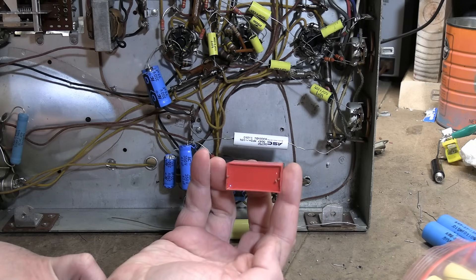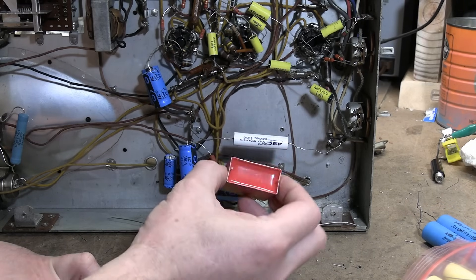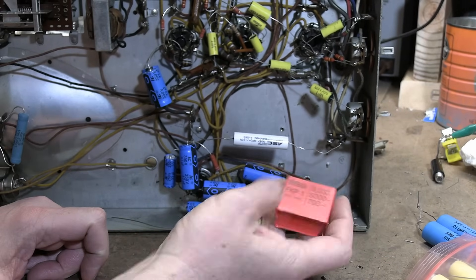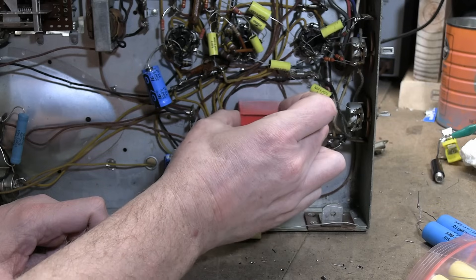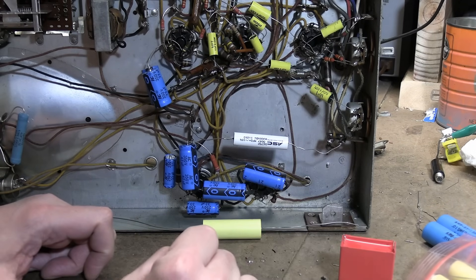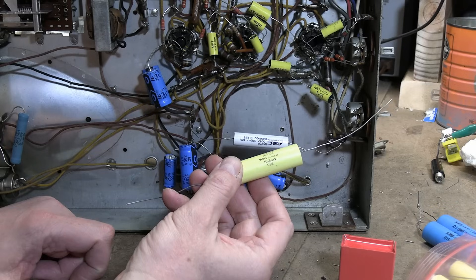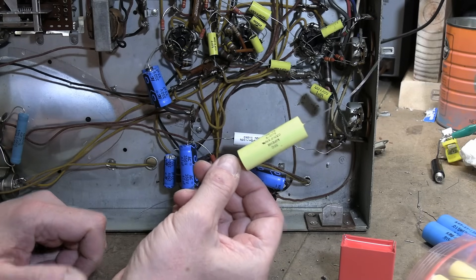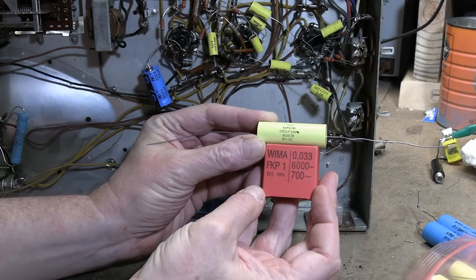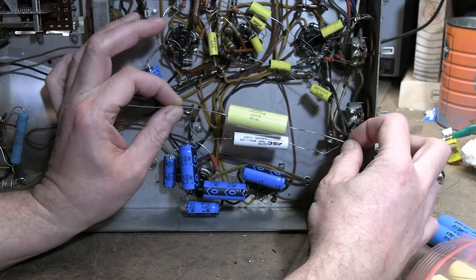There are only 6,000 volt caps left that DigiKey and Mouser carry specifically. I suspect these would work fine, but I would have to install extension leads — we need to go from here to here and from here to here. These are a bit heavy; I could attach extension leads, but if I put it in here it's going to weigh down the leads. I also got a tip from another viewer that there's an eBay seller selling these — he sells them three for 20 bucks. These are .033, 6,000 volts — same specs but a different form factor. Axials. And they weigh less, so they'll be supported well enough by their leads.